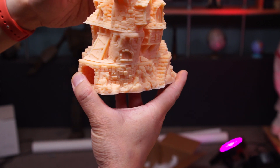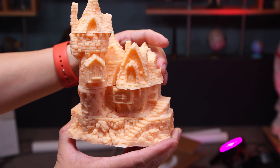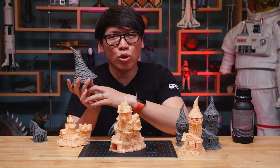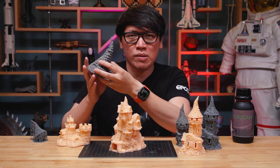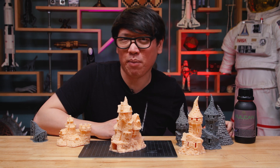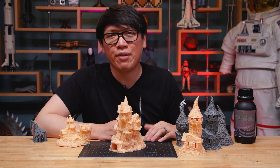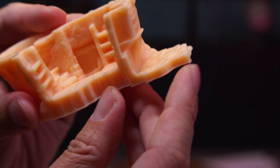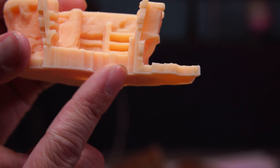I tried printing a bunch directly onto the build bed. One thing to factor in with resin printing is the elephant's foot. In FDM printing, if the first couple layers don't cool fast enough, they spread, giving you extra stepping on the base layer. This also happens in resin prints because bottom layers are typically exposed much longer — around 25 to 40 seconds — causing extra resin to cure, resulting in an elephant's foot on your prints.